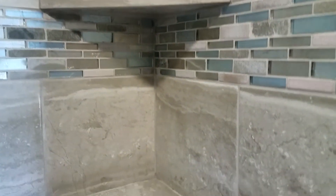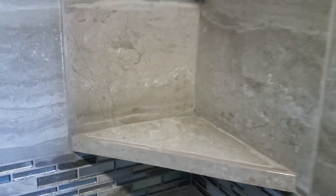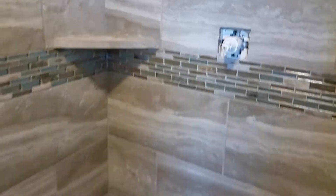Okay, here are the shelves — they turned out really nice. Now you can see how easy it really is to make a corner shelf using some of the tile you're going to be installing inside your shower, plus some bullnose. It's pretty simple. Just make sure you get that bevel on the tile so the water drains off, and you have a shelf that looks pretty darn good and is waterproof.